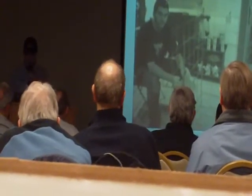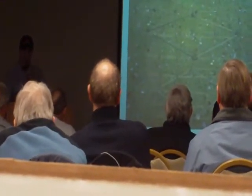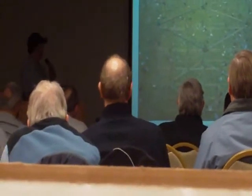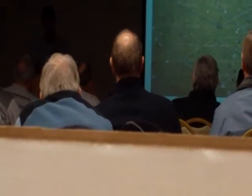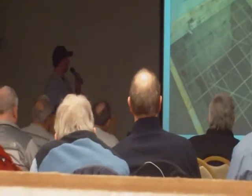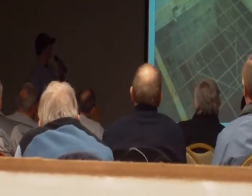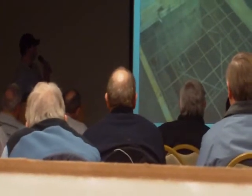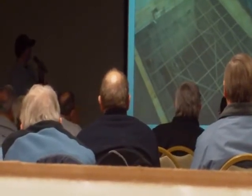These ones my wife shot, so of course they're a little blurry, but that's me putting the cage together. This is the cage outside — went with just some rebar reinforcement in the center, tied into the cage and wire tied it in. When it was in the hole, I later added rebar going on each four corners just to keep it in place and banged those right into the ground, so when the concrete was being poured it was going to stay in place. There is also a screen on top, just to keep it from cracking like you would with a sidewalk.